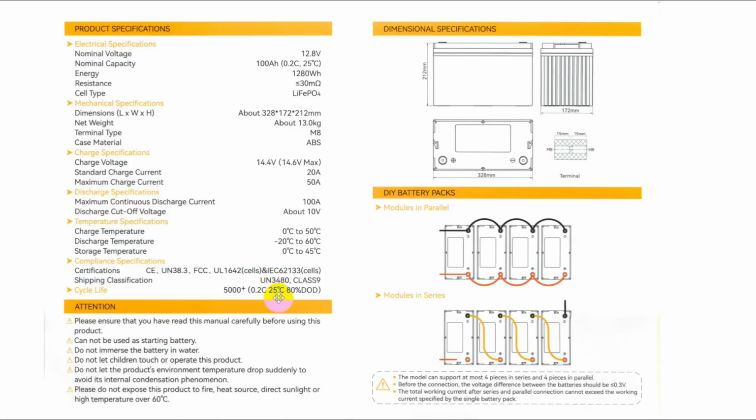Most lead acid batteries do not like being discharged that much. Now, the big lead acid batteries, the AGM batteries that are designed for solar systems, can be taken down to a fair depth of discharge, nowhere near 5,000 times. But the batteries that I have, my AGM lead acid batteries, I think I've probably let pretty well discharge only twice since I've had them. I've had them about 15 years.